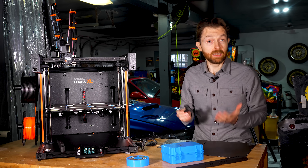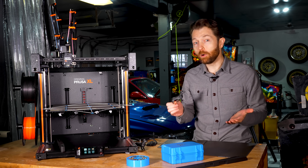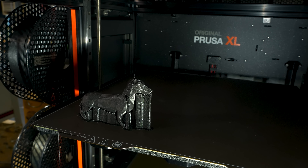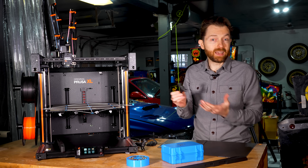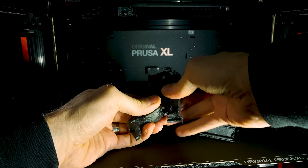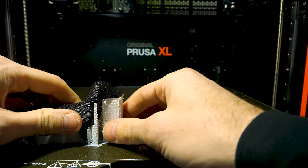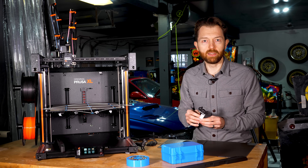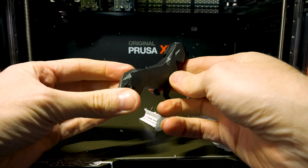That's the thing I was most excited about, especially when it comes to supports. If you're not into 3D printing, a quick explanation: in FDM printers, you're building up models layer by layer, which means you can only put plastic down on top of something else. If part of your model has nothing but air beneath it — like the stomach on our pooch here — you need to use supports, a sacrificial plastic that only exists to hold up your model as it prints. Once the model is finished, these supports need to be broken away, but since the plastic sticks to itself, this can be difficult without breaking the legs of our little dude. By having different types of plastic filament, you can create supports that will not stick to the model — you can even use water-soluble filaments that you can simply rinse away. Those are pretty expensive, so for this dog I used PETG supports, and it was much easier to pull away — it all came off in basically one big hunk.